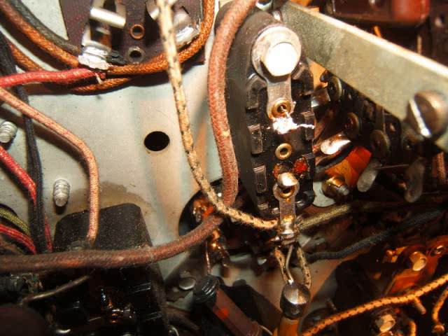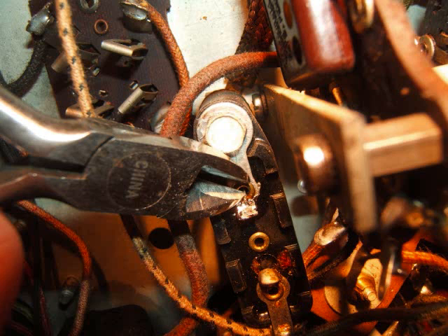I'm going to replace all the innards of all the capacitors — all 14 of them — I'm going to do all of them anyway, but I just wanted to check it first. So I unsoldered the lead and I'm just cutting off the excess.